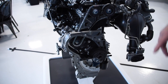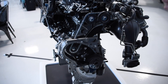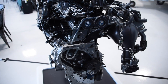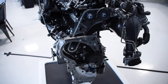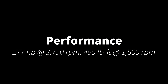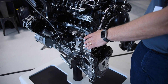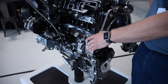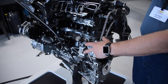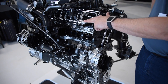Several other competitors have a full belt to do the entire timing system, which can be devastating when the belt goes. If or when the belt would ever go on this — well beyond 150,000 miles — you would be warned with the appropriate diagnostics and you'd be able to stop. Our fuel pump is a 2,500-bar fuel pump, delivering at 36,250 PSI maximum fuel injection pressure. It's a twin-piston pump that sends fuel to a common rail injection system.